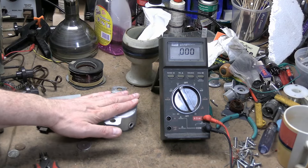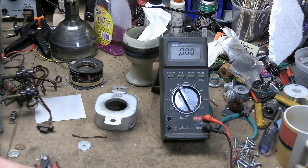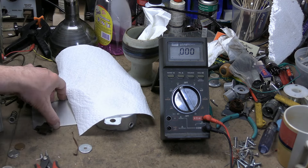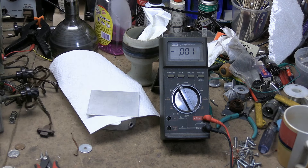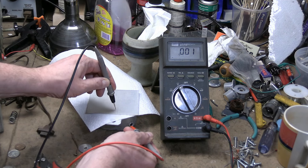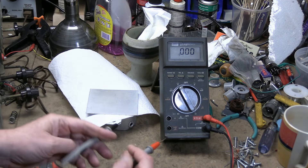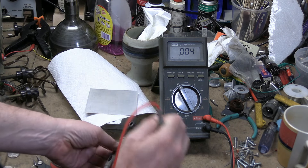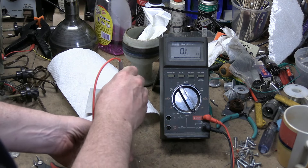I'm going to use the outside body of the focus coil as one side, and start with a piece of dry paper towel. I've got some aluminum, some copper, some zinc-plated steel. Let's start with the aluminum and dry paper towel, and go between them. Even with that, we get a slight negative voltage. Let's go the other way — slight positive. Let's put that in resistance mode: nothing.